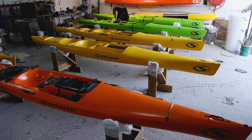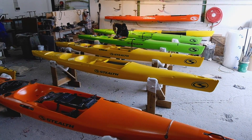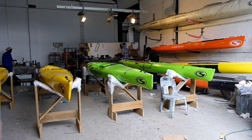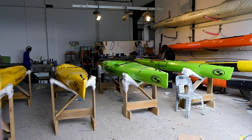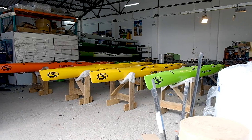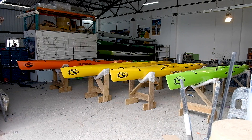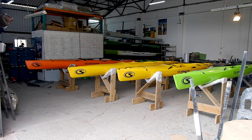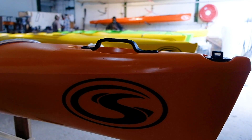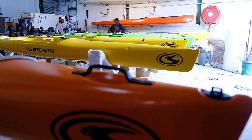When you create the buoyancy of a kayak, we have to have a minimum of 33 percent built-in buoyancy provided in the kayak — that's 33 percent of the kayak itself. The integrated foam, which is molded into the polyethylene as aero foam, creates a foam skin on the inside of the vessel. The aero foam has a closed-cell structure and does not degrade from exposure to water, so it won't absorb water or get heavier — the water doesn't affect the foam.